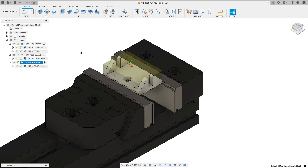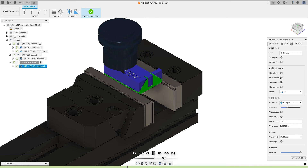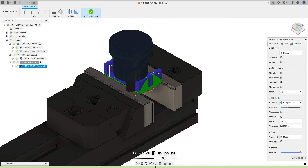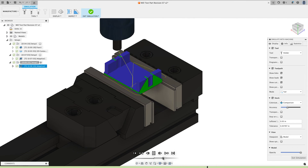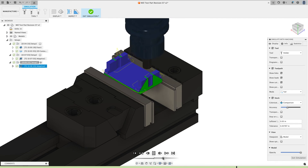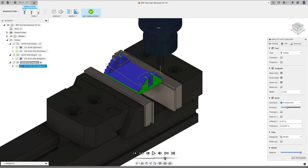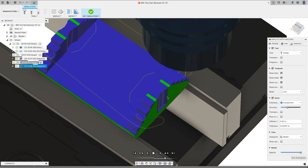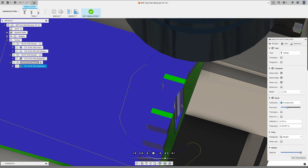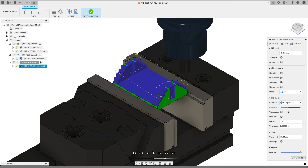The toolpath has completed. I'll click on my setup, choose simulate, and watch what the tool does — it goes adaptive across the bulk of the part. Slowing down toward the end, you'll see that once it finishes removing the bulk of the material, it starts stepping up the angled faces 150 thousandths at a time. It's not very efficient though — it's machining all the ridges at the same depth and jumping around a lot with transition moves. We also left a lot of material for the ball mill to come back and finish later.